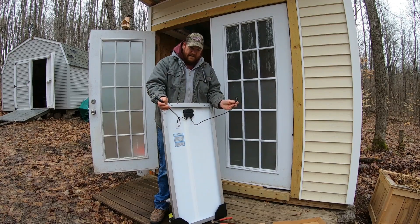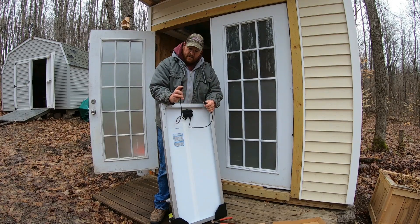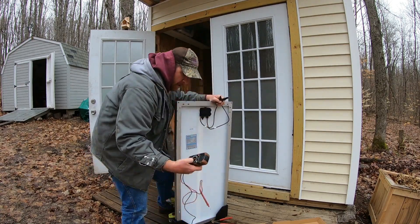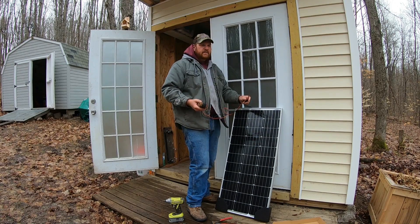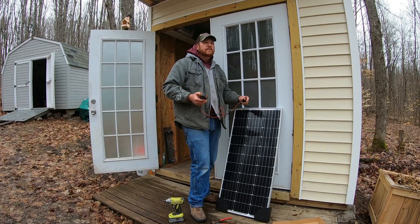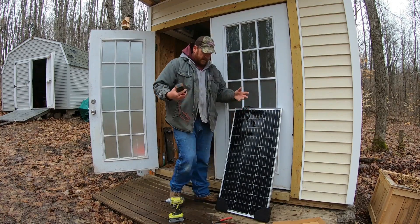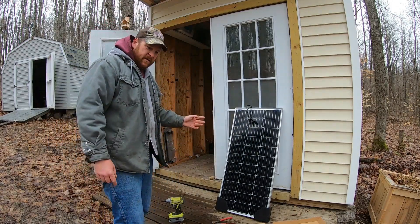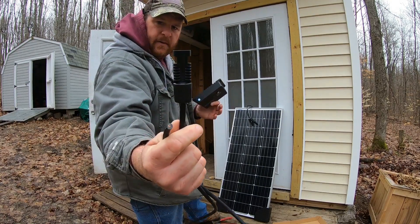This is, again, positive and negative — they are marked. The positive happens to have the male portion, the little clip here, and the negative is the female. That makes it dummy-proof so we can't hook the wrong wires up to the wrong spot. Let me see what voltage is coming out of this solar panel. 19.98 volts coming out of there. So we're getting about 20% efficiency even with no sun — it's as cloud-covered as it could be, absolutely zero sunshine today. So that's good — I know it's working and we're getting voltage out of it. That's why we have to hook the solar panel up last. We don't want to clip into this and have live wires.